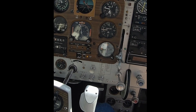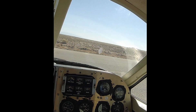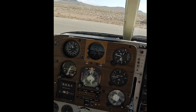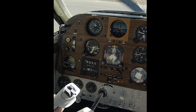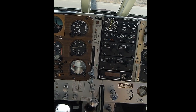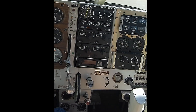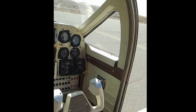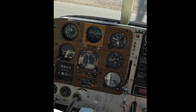In the airplane, I can see that the oil pressure is registering in the yellow. I'm getting the instrument to work, but the needle is not really moving that much. So I'm suspicious that we still have a continued problem with that instrument, and I'll be replacing it. As I was testing in the airplane and had reconnected the vacuum hose that the previous owner had disconnected, I'm noticing that the yoke is moving progressively to the right, and I'm having to fight it to keep the ailerons level. It's progressively going further and further to the right, so I start troubleshooting the autopilot.